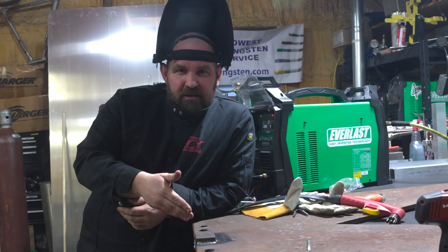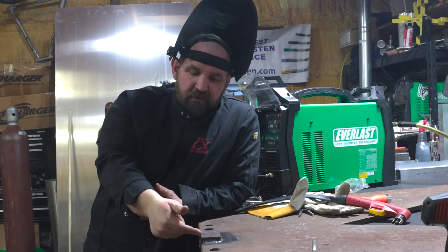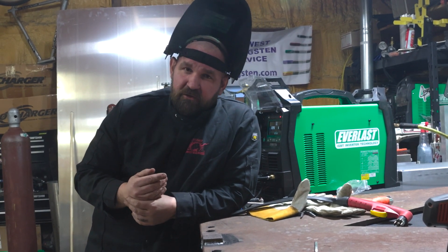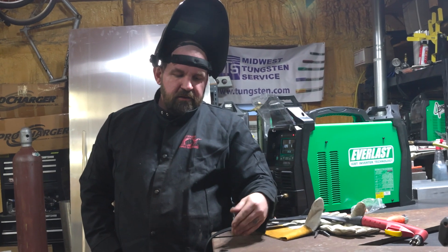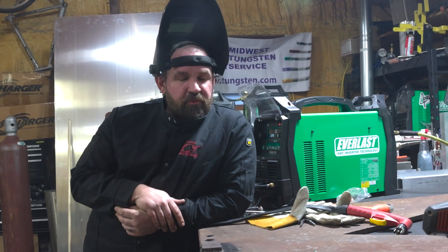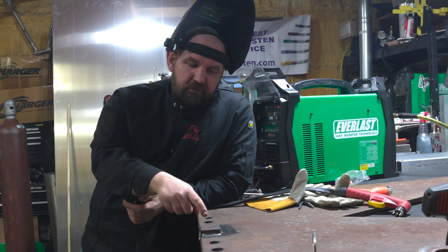It did it. We just got done testing this thing. We did a one inch severance cut — you saw it blew right through it. We only rate this machine to do a max of 5/8 severance. And you can see in the split-up video, it actually welded this half inch plate pretty well using .030 wire. It was turned up, but it welded half inch plate. And even more impressive on this cut, we ran it off this little job site three-and-a-half gallon Ridgid air compressor that's 15 years old. So we saw the little trick for piercing thick plate. Again, we were over the maximum rated thickness. As an Everlast welder, I'm kind of surprised we underrate this machine as much as we do. We saw that half inch thick pierce, the trick for piercing thicker plate and making it easier on the machine, and we also did some half inch welding with a one inch severance.